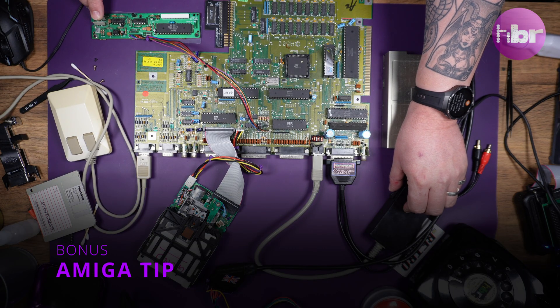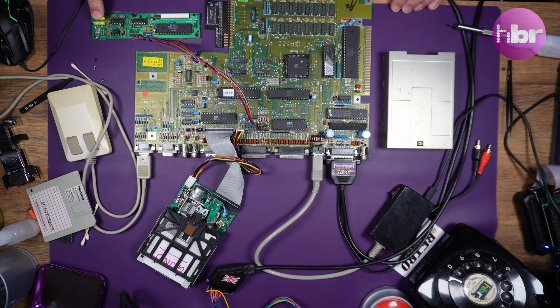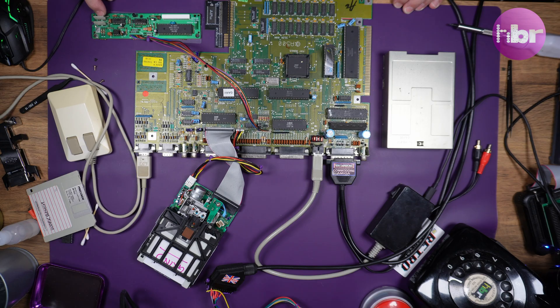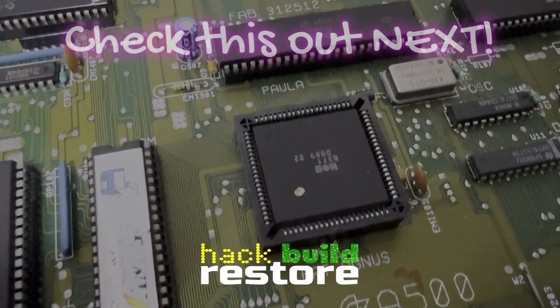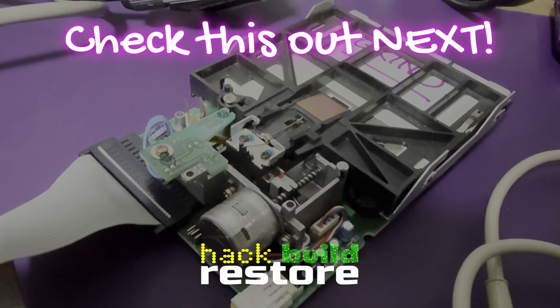Just a little note on the rev 5 with LEDs, which does occasionally catch people out when loading games. You'll notice the light comes on - we've got power, got floppy activity, this is loading Grind. One of the things Grind does is change the low pass filter setting. When you do that on the rev 5, it will turn off the power light. As soon as it finishes loading - there we go, both lights have gone off. The Amiga is still on, still running, it hasn't crashed - it's just the low pass filter. If you've liked this video found it informative or entertaining, please click like, and if you want to see more videos like this, click subscribe.